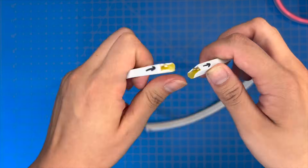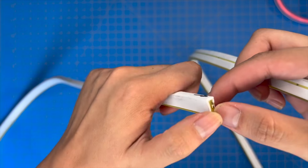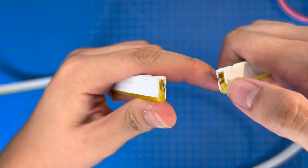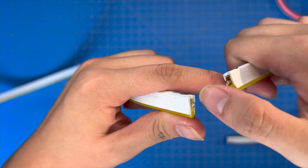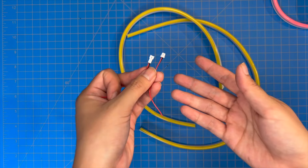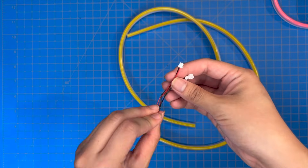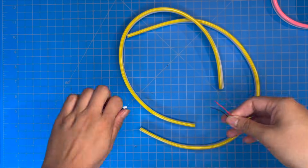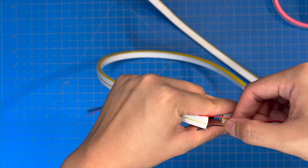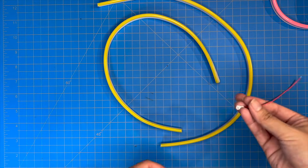I track strip direction with just a little Sharpie arrow. There are these little copper pads on the inside where you can solder, and you can basically take wire, make sure those directions match up, and connect the top pad to the top pad and the bottom pad to the bottom pad, and then it will behave as if it is one continuous strip. To make my life a little bit easier, I've decided to use these connectors — instead of soldering wires straight across, I want to be able to easily swap in and out these strips in case I accidentally mess up the circuit, which I'm almost definitely going to.